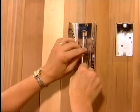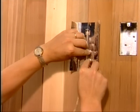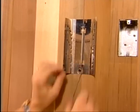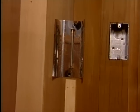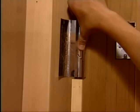The bulb and wire must be completely pulled out, taking caution not to kink the wire, run it up the wall, and cover it with the molding supplied. The sensor wire must not be punctured when nailing the trim piece in place over the wire. The metal bulb guard will hold the capillary bulb in place.